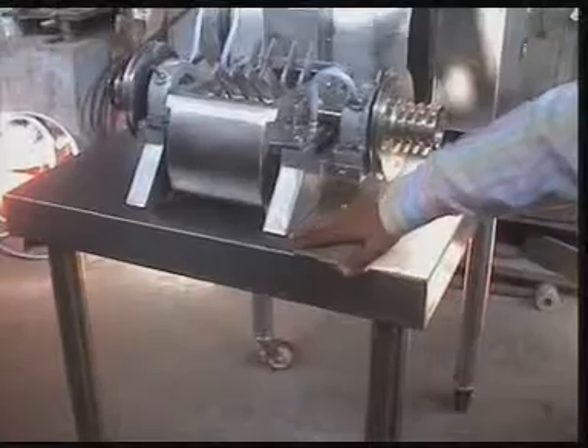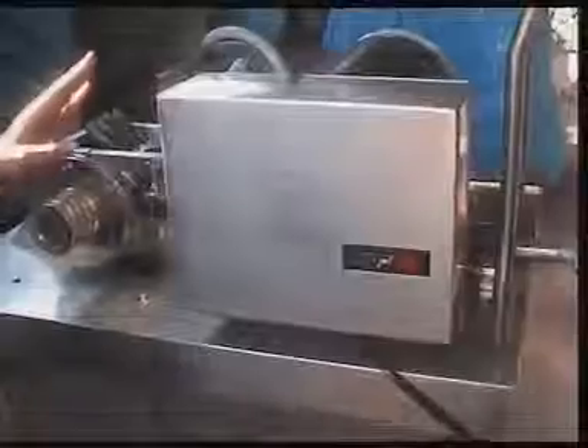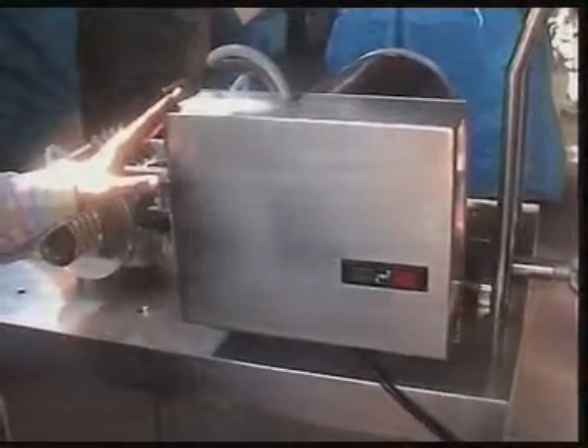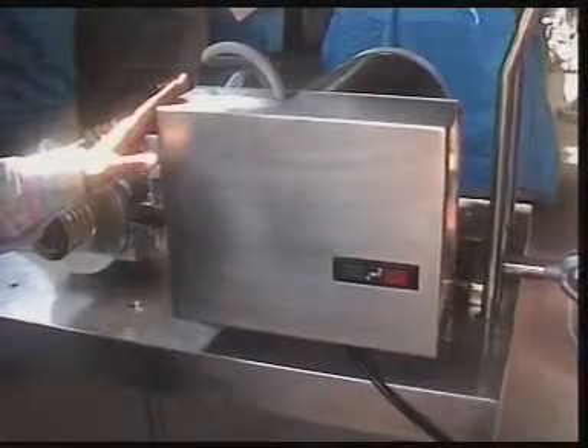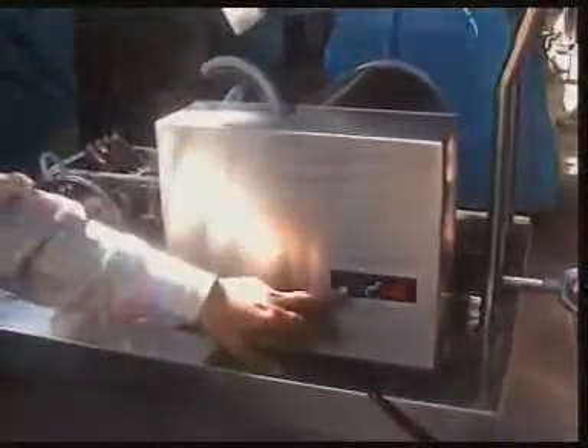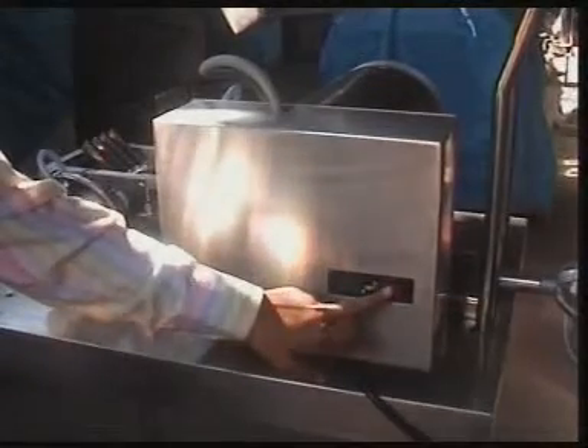This portion is considered as the front of the machine. This is the main starter of the machine. The starter is a star delta starter, fully automatic operating, and it has only two simple buttons: green for starting and red for stopping the machine.